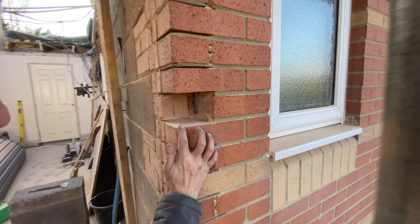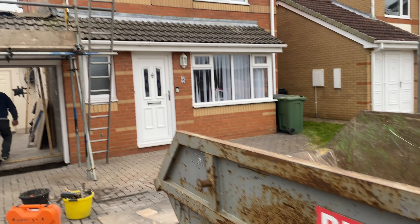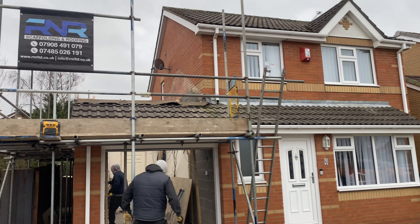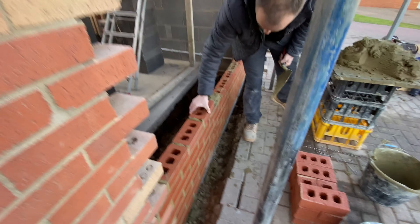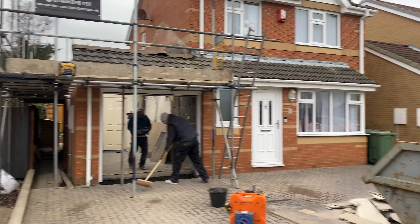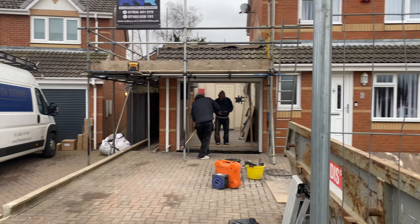The job is to build an extension on top of a garage. There's a garage door which needs to be bricked up. That garage door can be bricked up first. The company takes the roof off and strips the brickwork in the garage peak, and while they strip that back the scaffold goes up, ready for us to jump in and start taking the extension up to the wall plate.